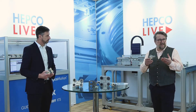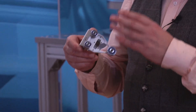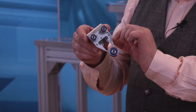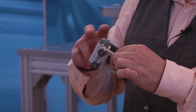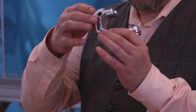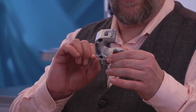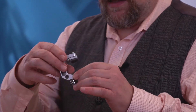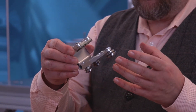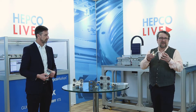Well, the most obvious difference is the size of the bearings — they're much smaller. They're also more compact relative to the mover body itself, so there's less of a lever in the drive force. The body is lightened and made more compact to give us a bare mass of around 200 grams.